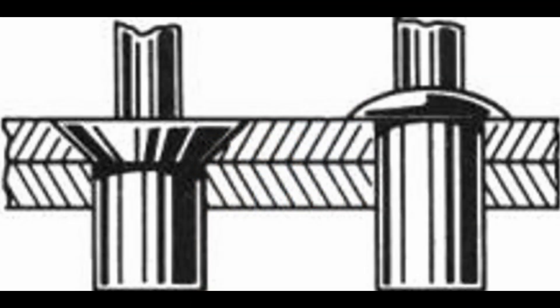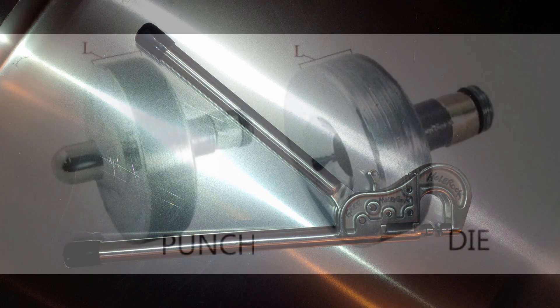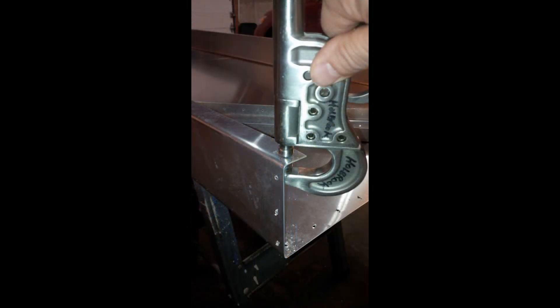Where the glass will lay flat on the face of the solar air heater box, it is necessary that I install flush rivets rather than surface rivets. For that you need a hand rivet squeezer with a punch-and-die dimpling set to place a small dimple for the rivet to rest in. The finished product produces a flush rivet.